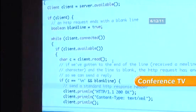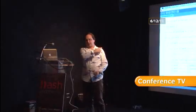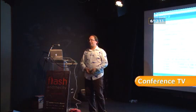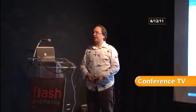Do you have any particular practice you use when you decide what to use for your MAC address? Yeah, the address that I've got there is a MAC address for test devices. There's a bit of a problem because there was some Microsoft hardware that got released that had the test range on them when they shouldn't have. But it's pretty unlikely that you'll run into any other collisions there. Yeah, exactly. It's the same as like net 10 addresses, like 10.0.0.1. If you look up the documentation on the Arduino, it has recommended ranges that you should use.